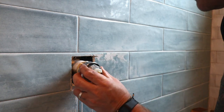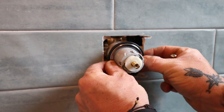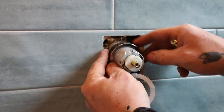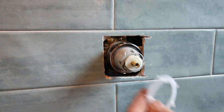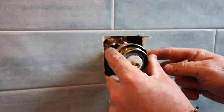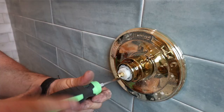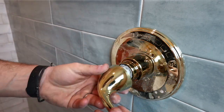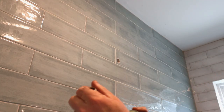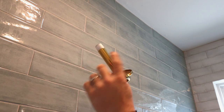Your ring goes back on to hold it in place. Next we have our O-ring, which steadies the brass sleeve when you put it on — it will sit right behind this nut. There's also a spacer. Then we're going to install our shower head and the shower head arm with a liberal amount of Teflon tape, and we have our spacer cover that slides right on over it after you get it installed.